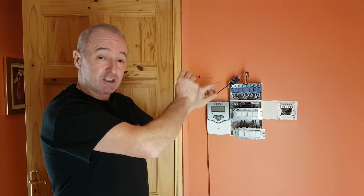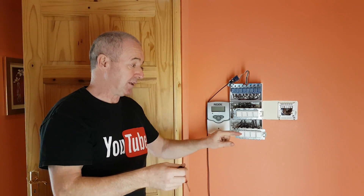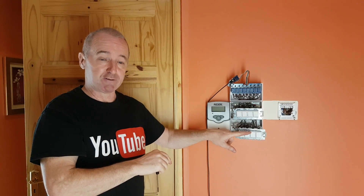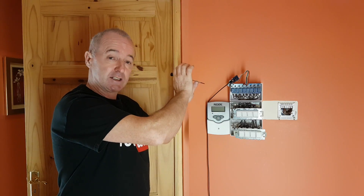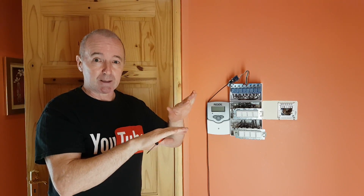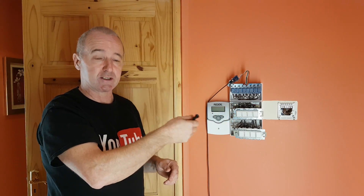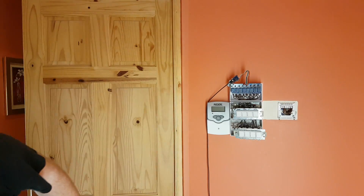The D1 mini gets fed with a standard mini USB — like what you charge your phone with — that's powering this end of it. The high-voltage side is different. I have to make a compromise: when using the relay setup the switches need to be off, and when I want to use it manually the D1 mini, Alexa relays and everything just need to be unplugged. Two separate systems using the same hardware — connected to the same boiler, underfloor heating pumps, and actuators.